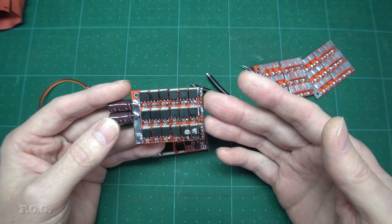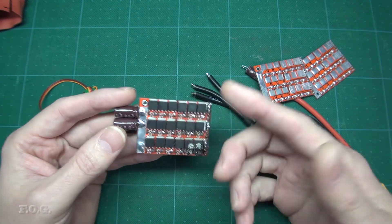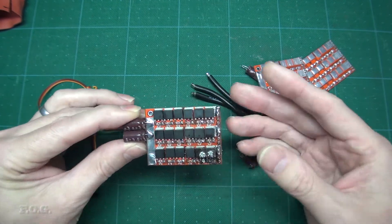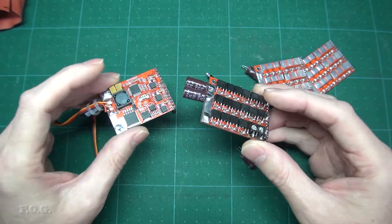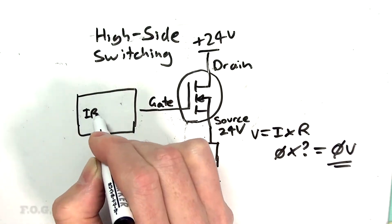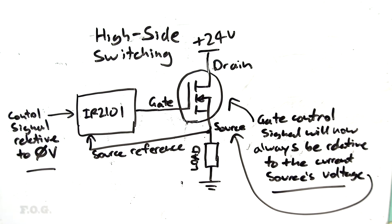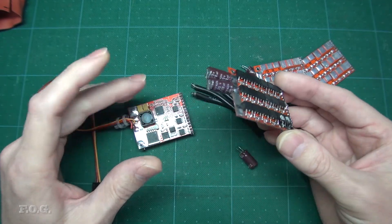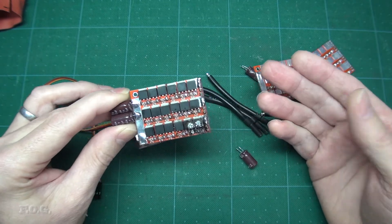So to reliably switch a MOSFET on or off in a high side situation, we preferably need to create an on or off voltage which is always relative to the source, not relative to the power supply's ground. This is the most important thing the IR2101 chip does, and why it exists in this design. For the low side, the IR2101 is really only acting as a simple buffer, with the on and off signals relative to the power supply's zero-volt level. But for the high side, the on and off signals created are floating — created relative to the current voltage at the MOSFET's source, regardless of instantaneous supply voltage, load, or switch state. The voltage used for the on state is taken from the chip's supply voltage, which can be from 10 to 20 volts — in our case 12 volts, as supplied by that 662 chip.